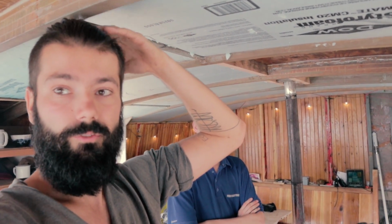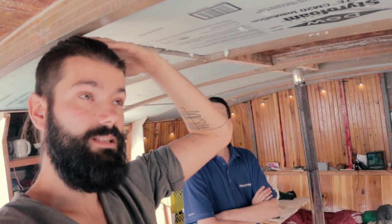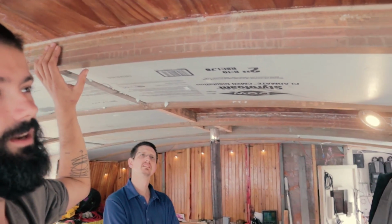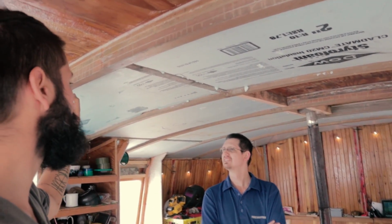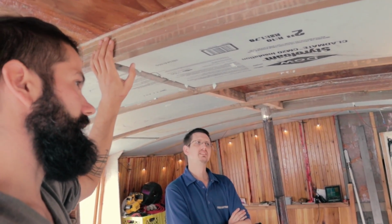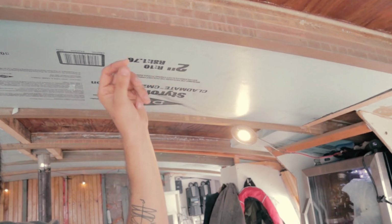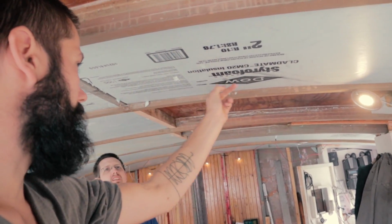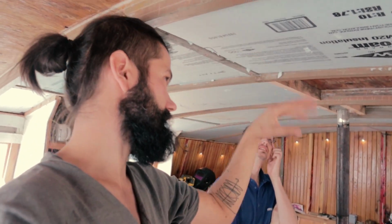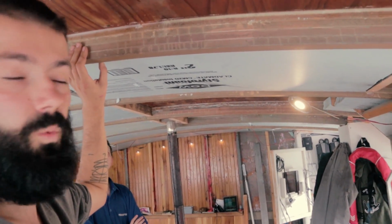Now, before we had the pieces tacked on top of these beams, because these beams are laminated. They're a little ugly. They're not very pretty. So I didn't really want to have them showing. Now, instead, what I've decided to do is to use my 2 inches of insulation, then a 1/4 inch of mahogany plywood board, and then on that I can put varnish and stain and everything else and make it slick and smooth and beautiful, and then I'll paint these white.